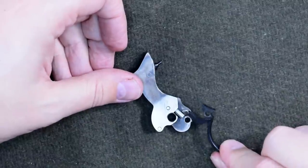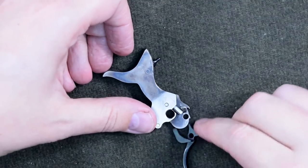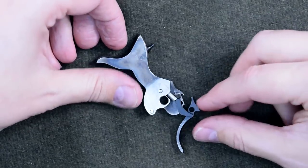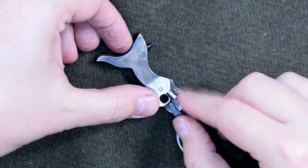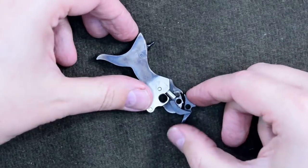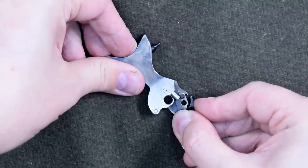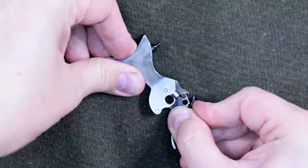When you pull the trigger on this particular design, a little extra extension that's been added to it hits this plunger right here, which is attached to the transfer bar mechanism, or practically is the transfer bar mechanism, although it is sprung downward. So when we pull the trigger, it would, as it was assembled, and it's kind of hard to do outside the gun because there's none of the tension that's supposed to be there and the parts aren't held in alignment, but I'm going to cover up a little bit of my work, sorry guys, but this would be here. As you pull the trigger, it's going to push that guy in like that,